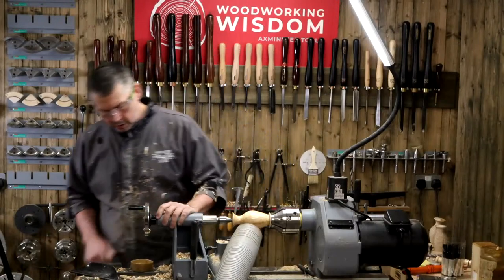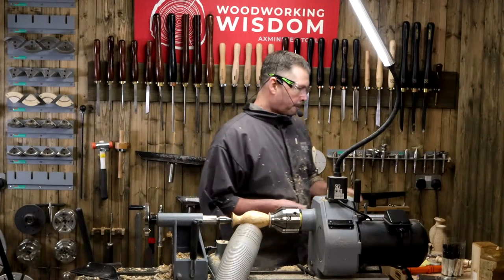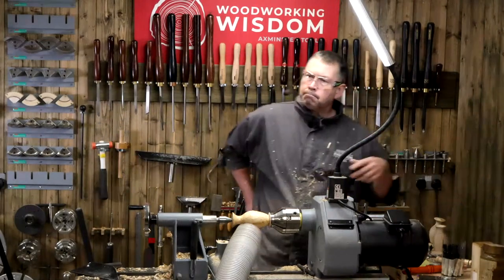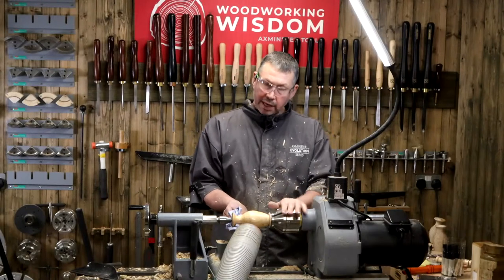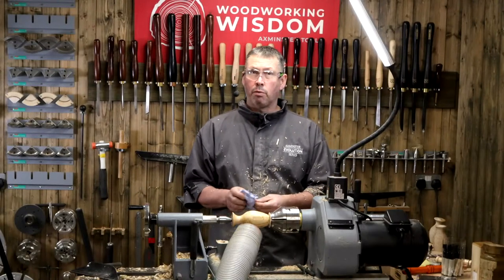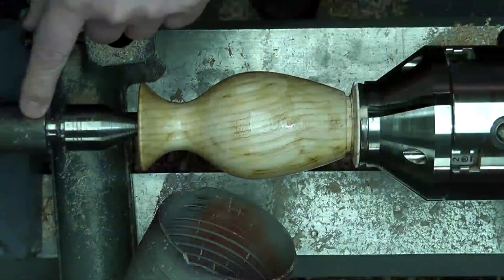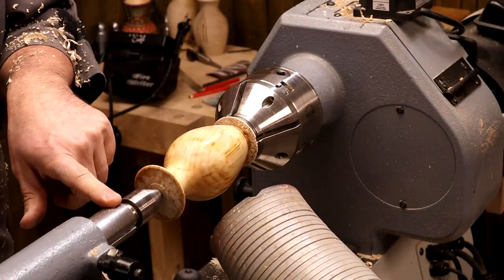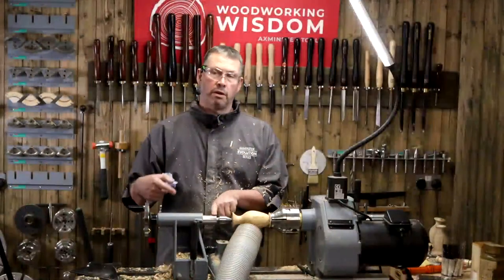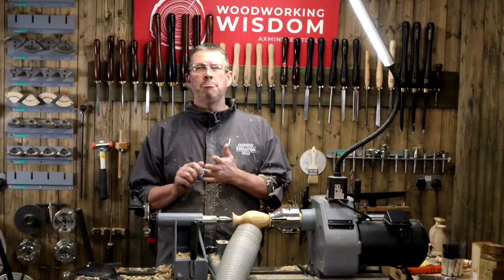In the inside of the tailstock. He says on the backside or the inside of the tailstock. Well, there is a lead screw on the inside. It might be that one. So you've got this part of the quill. It's a female thread in there, and you've got a male version on the back of the handle, or inside the handle. That's what that's locking into. So they thread together. So it might be that you're seeing, maybe.